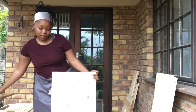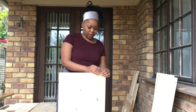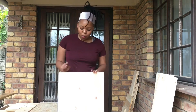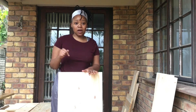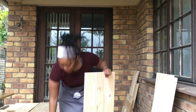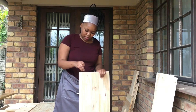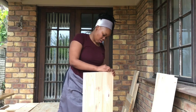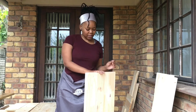I want to show you guys something real quick. I've drilled my holes, but as you can see my pin is sinking very, very deep inside the wood. We don't want that because we want the pin to fit snugly and properly into the pieces we've previously drilled. So what we are going to do is take the drill dust from drilling and fill the hole with it. Then you see — awesome! And obviously when we're putting in the glue, the glue will also play as a filler.